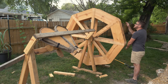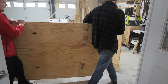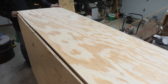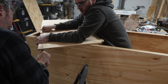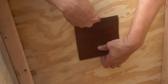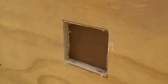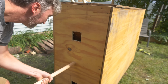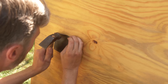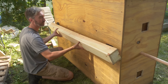In one of my earlier glassblowing attempts, before we switched to the successful natural draft design, we attempted to build a water-powered bellows system as well, which sort of worked — but ultimately did not move enough air to be really effective. So we want to build something as big as possible to give us the best possible result. The design is simple: it's just a big box. We add an extra panel inside for the plunger, which pushes the air either way as it's pushed back and forth. Then we cut the vent flaps with leather covers on the inside — these seal shut whenever air is pushed against them, creating a one-way seal. Outside vents are added where the air will be pushed out, connected with a wood channel so all the air exits at a single point.